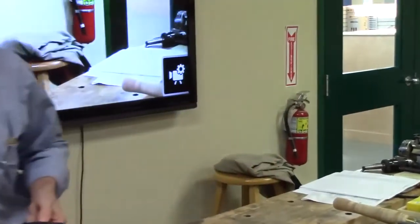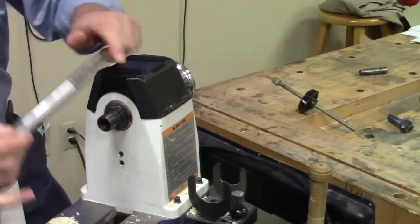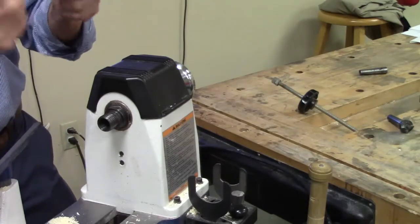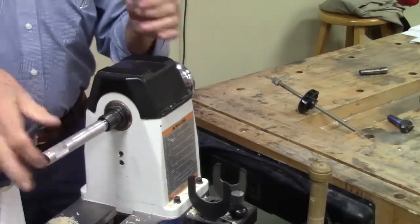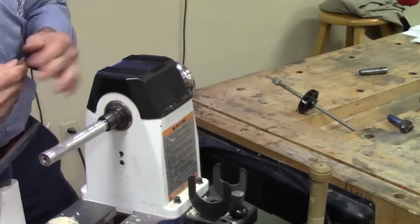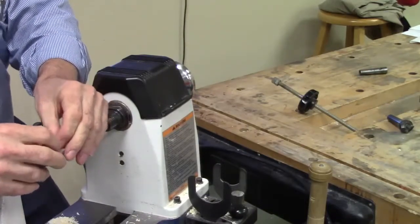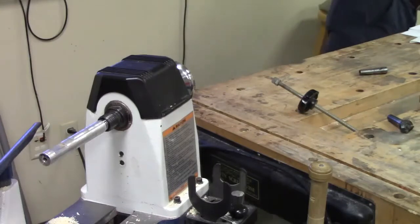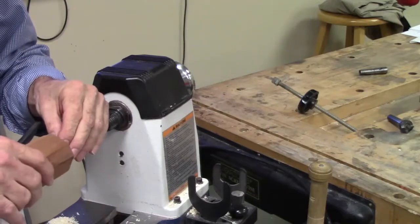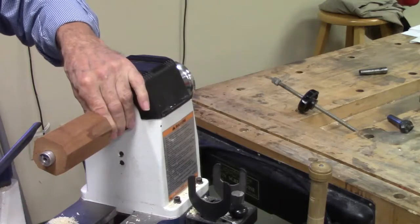But they're very great for doing mandrels, because this is the 1/2 inch, so you can just make a 1/2 inch shaft on your mandrel. It's a pin mandrel that would go in like that. We would draw that in with the drawbar, we would grip that. Good concentricity, and then this pin goes on. I bring a block of wood, so this goes on over that pin. I can come into this.